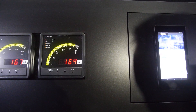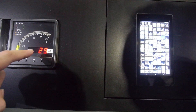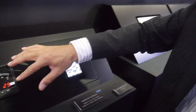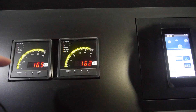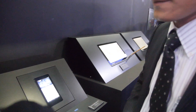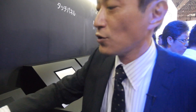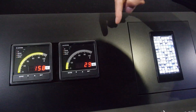This is very low power for a backlit screen. To be fair, this does not include the backlight power — this is just the panel driving power. The backlight is much bigger. But you can see more than 100 milliwatts saved because of the low-refresh screen updating.